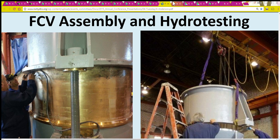They were also able to fulfill some of the requirements to provide controlled-temperature water for the Feather River, satisfying mandates about protected species — the fish in the Feather River. That's because the water at the bottom of the lake is colder than at the upper levels of the reservoir, and the river valve outlet system can provide that cold water, which enhances the fish's environment.